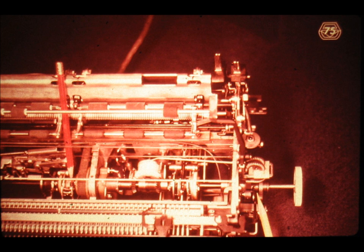Slide 75. Immediately to the left of the drive pulley, red pointer, we have a very important friction or spring clutch called cycle clutch. Actually, it is the print clutch, since it is used whenever the typewriter prints a character.